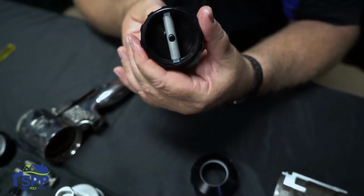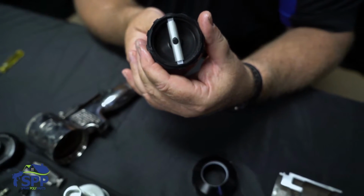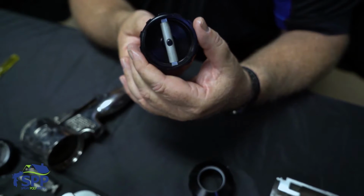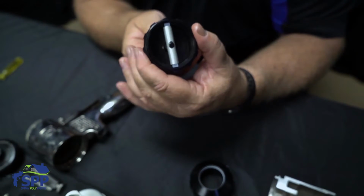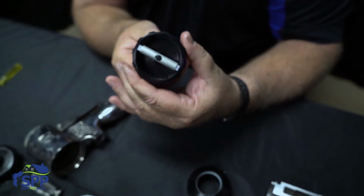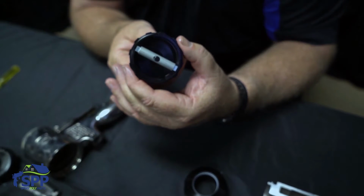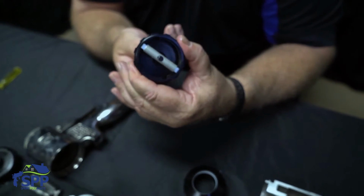As you can see, that's how the safety works. Here, it is disengaged. That will allow the air cylinder to move the full travel so that it aligns the mixing chamber so that it sprays. Here, as you can see, it's higher up, and it won't allow the air cylinder to come back far enough to engage, so it will not spray.